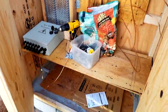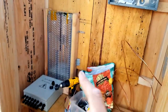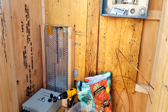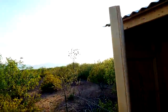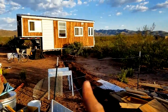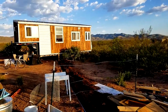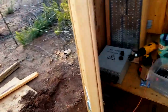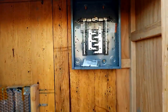Here's the makings of the electrical closet. This is our second Tesla battery — the other one's currently being used. With two of them, that will give us 500 amp hours at 24 volts, which should be enough for the big house and everything we want to do. Eventually this whole area will become my workshop and I'll mount the solar panels on top. The solar panels come in to the PV combiner box, that goes to the charge controller, then to the batteries, then to the 4,000-watt pure sine wave inverter, and then to the breaker box, which goes to everything.